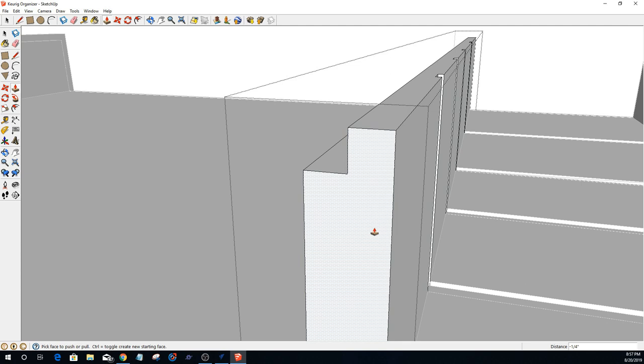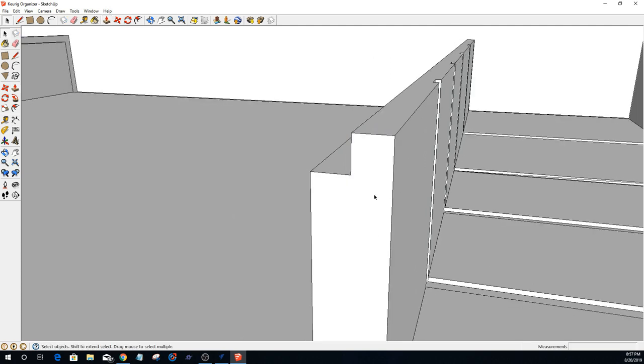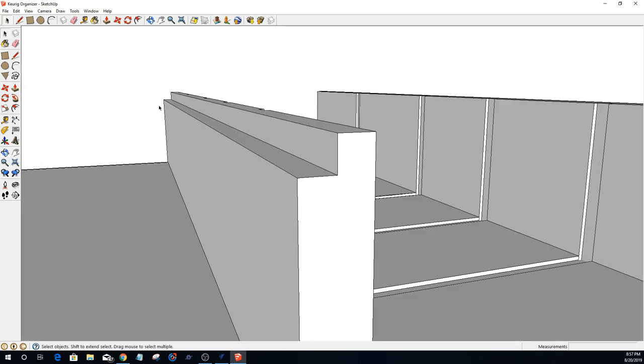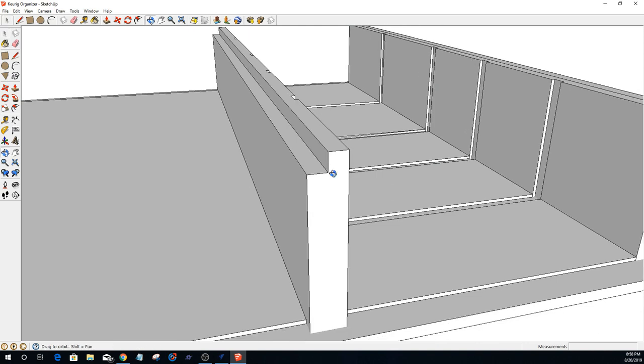So technically, it's a two-sided part, right? Well, I'm going to be cutting the grooves on the side, but I'll just end up cutting that rabbet. I'll put a quarter-inch end mill in my router table, and I'll cut that rabbet very quickly and easily. If you don't have a router or a router table, what I was talking about with the handsaw is you could draw a line straight down, cut down and then cut over, and remove that corner piece. Then clean it up with maybe a little chisel or what have you. If you're into hand tools, or if you have hand tools, you could do all kinds of things.